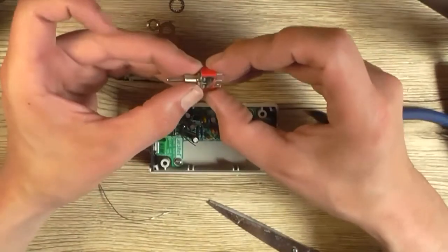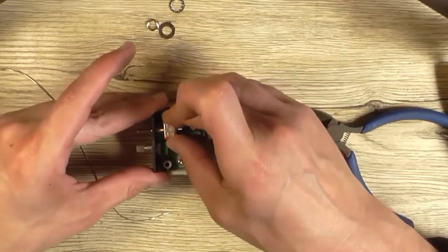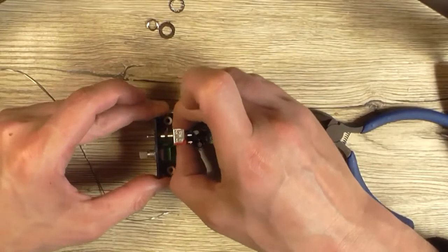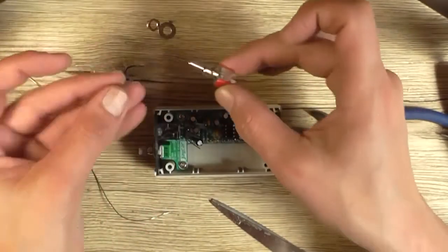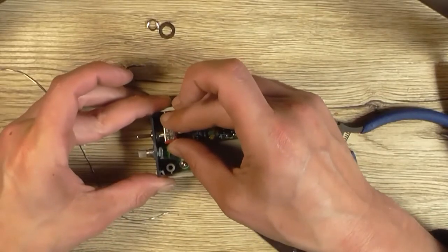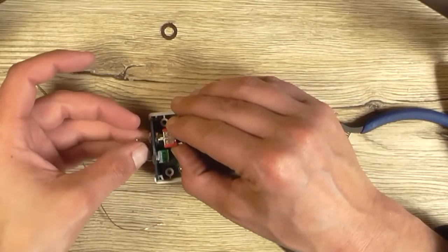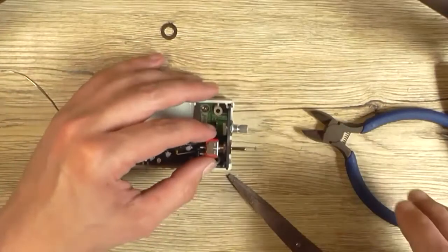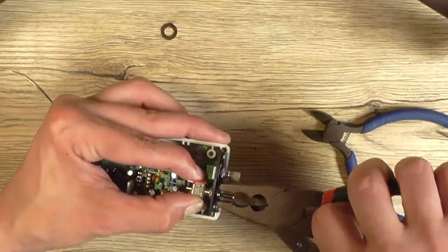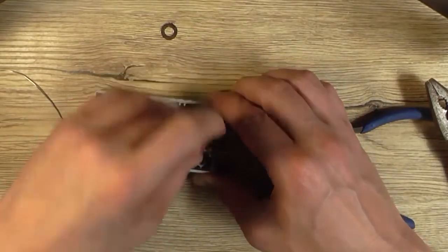Moving on to the switch. Now, they have a nut here to adjust the depth. So, I'm probably going to adjust it so that the depth is as minimal as possible. So I want it around about there somewhere. So I'll take that in. I'll use this shake-proof washer on the inside and just leave it with enough threads poking through on the outside to do it up. So, just tight as I want to get that. Oh, that was not what I intended to do.